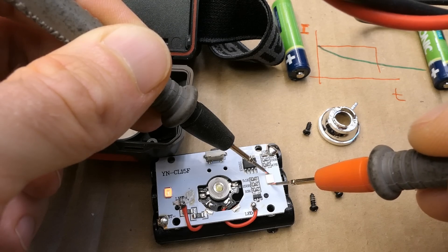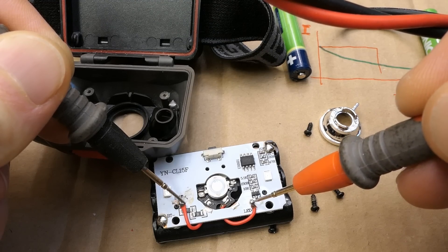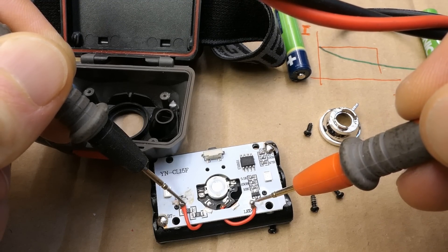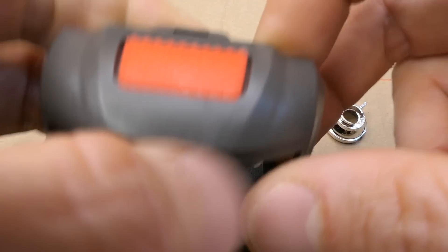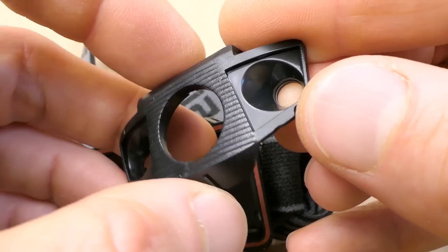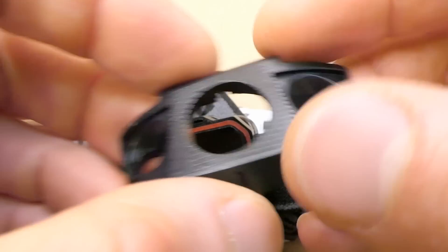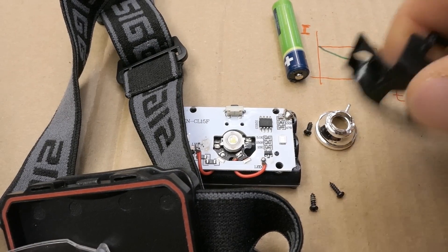The red LEDs actually dimly light up using the diode test of a multimeter — even the white one lights up, though not all multimeters can light up a white LED since it drops more voltage than the red LEDs. You'd call these reflectors if they weren't made of black plastic — most of the red light is wasted in this black plastic, which is a bad idea.